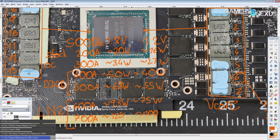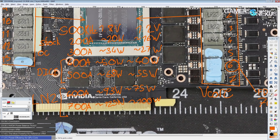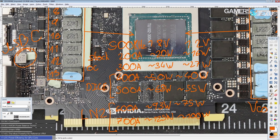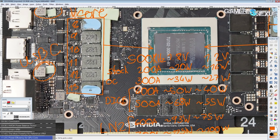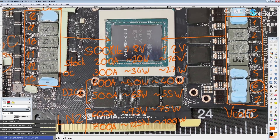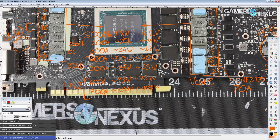On LN2 you'd actually be around 1.4–1.5 volts, so the VRM heat would be somewhere between those two figures and would get very hot. But with a high RPM delta fan and maybe a heatsink on the MOSFETs, it should still be manageable — especially since you're only hitting that current for the duration of a benchmark, not running it for hours.